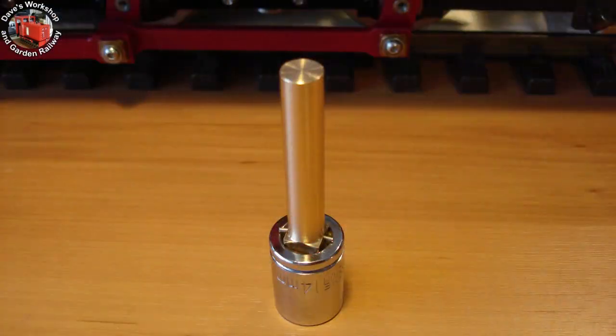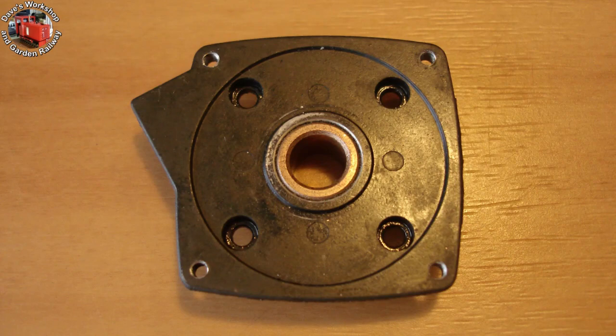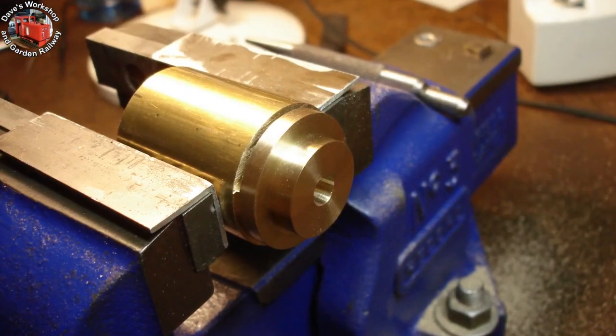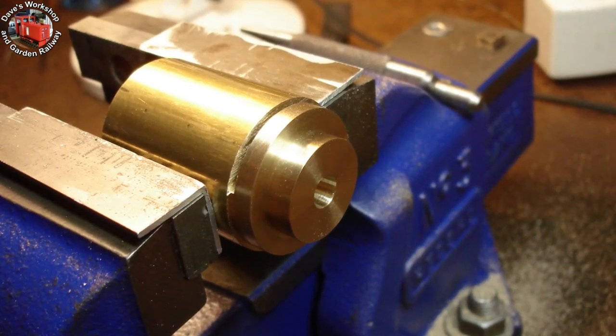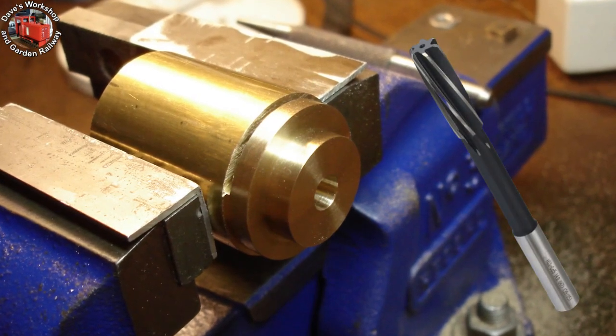The starter has a pin to push the socket onto the one-way clutch, and there's a pin on the other end to extract the socket. Here's the recoil starter rear adapter — it's shaped to match the profile. I've turned one out of 1.5 inch brass bar and put the original back in its box. The bore is 8mm; luckily I had a machine reamer for that.